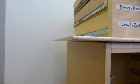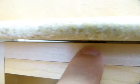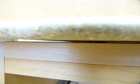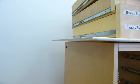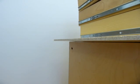Oops, slight boo-boo. While I was drilling it just now, this countertop uplifted because it's already curving away. Not only that, but when it uplifts, the wood shavings are stuck in between the top rail and the underside of the countertop, right about there. That's a pile of shavings that need to be removed from there. So it's not possible to compress or push down the countertop as is with those shavings in the way.